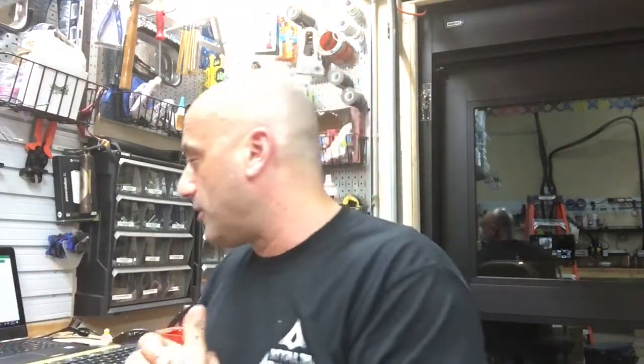There's plenty of motors where 30 seconds at full throttle is going to fry it. All right? Or it can't handle a 6S, but because somebody says, well, the ESC said 6S, the PDB said 6S, the flight controller said 6S, it's 6S. No. It means it's like 20-something volts. It can handle 24 volts or whatever. But it doesn't mean that it can handle the amp pull and the current that's going through. That's what we're doing. So I'm going to put all the numbers together and get some for you guys.